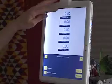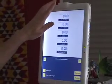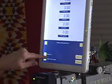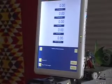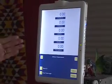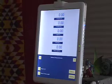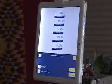It will measure correctly. Now, you may get a number that says 0.05 — that's okay too. But anything greater than that, you will see a message that asks you to repeat the calibration, so you just need to do it again. If you can't get it to read 0 or 0.05, then there's something up — either your table isn't square or the carriage that your machine is sitting on isn't quite straight, and you need to sort out those problems. So there you go, calibration — easy. Thank you.